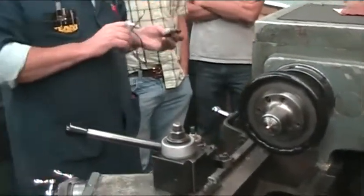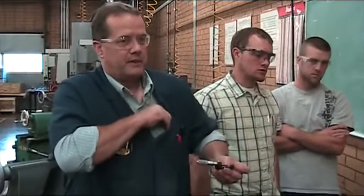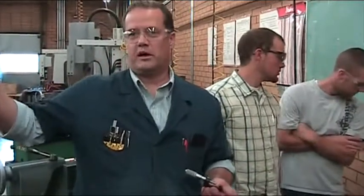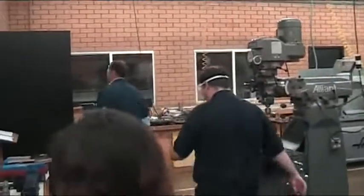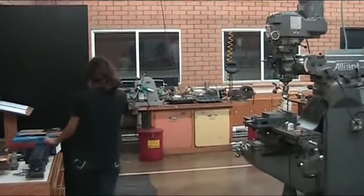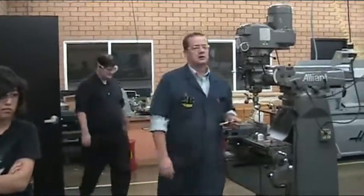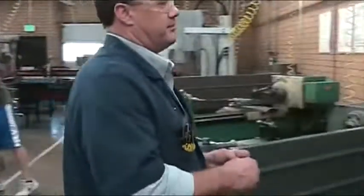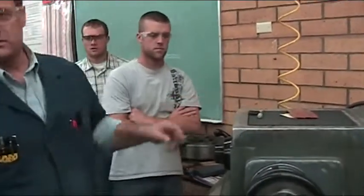At 69, it's a little bit bigger than our thread's supposed to be because we've got, what's our tolerance on the measurement over the wire? Did anybody write that down? It's on the board, right? 261 to 258. Okay. So I'm just going to go in a thousandth at a time. And then we'll probably not use that wheel.